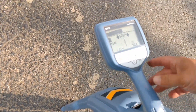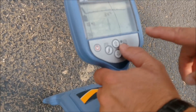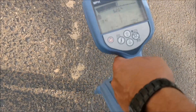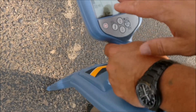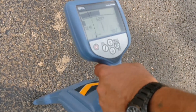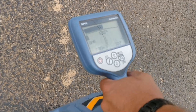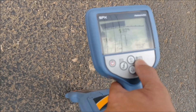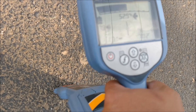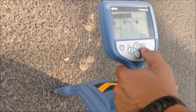A couple of other things on the locator — you have an antenna configuration button, that's your last button on the right side, and that chooses how you want the antenna response to be. The first one is your peak response — that's the big hill icon. It's a very accurate and quick response; you can see it going up and down. It doesn't have the arrows, but sometimes this response locates better than the arrows. It's also very quick in the audio response range, so when you get used to the audio response in this mode, you're going to become a real quick locator and won't have to watch the screen so much. If I push this button, it goes to a peak and null response — that's the icon that looks kind of like a spider with four legs — and that adds arrows to your peak response to help guide you left and right. Also a very good response.